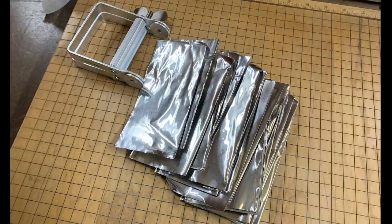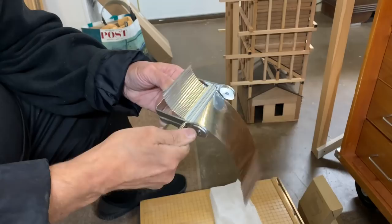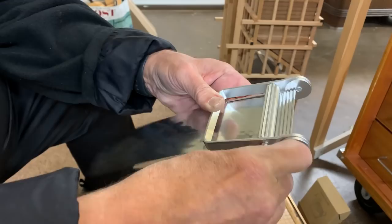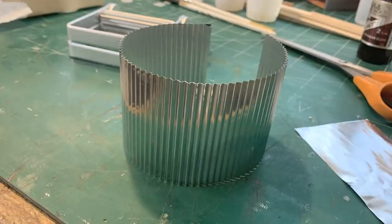You just cut your metal down to four inches wide and then some manageable length. You want to keep the length fairly manageable as you run it through the squeezer. I'm actually running too much through here in this video and I learned my lesson — just run maybe five, six, or seven inches through at a time. You'll end up with panels that look like this. They look brand new though, so we've got to work on that.